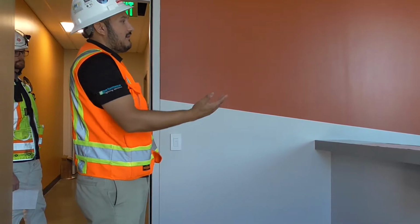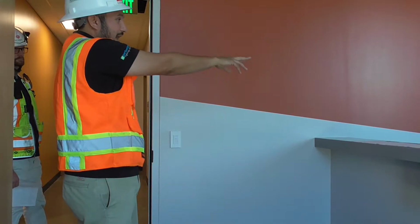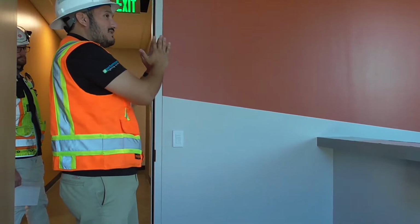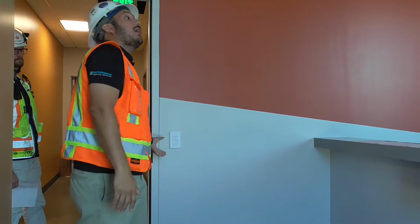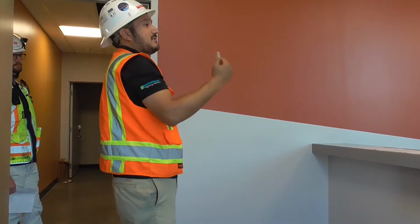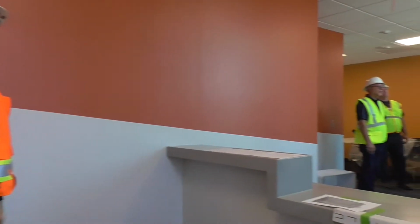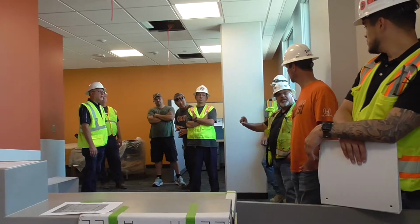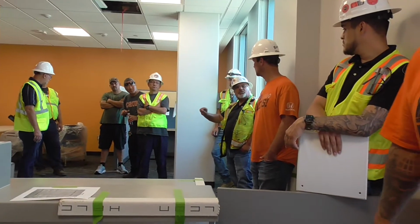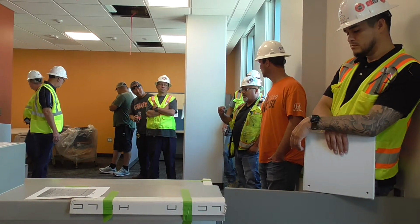So like I said, in this area right here, I'm looking over there, I see duplex or 4 outlets. You might have 2 on one side controlled, the other 2 are constant hots. Or you might have some where the top is controlled and the bottom is constant. What we did here is, they actually say on the plate that it says controlled, and then there's a black mark on the actual part